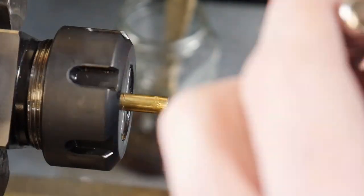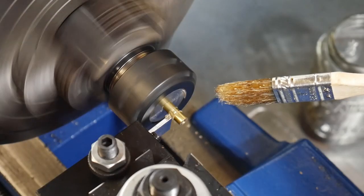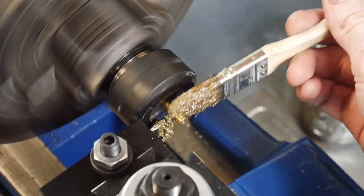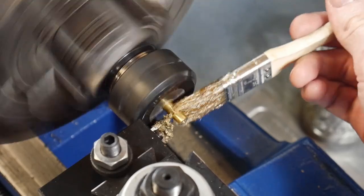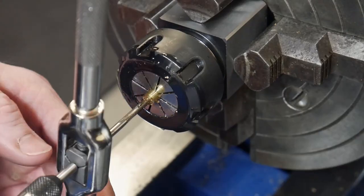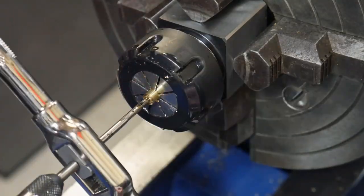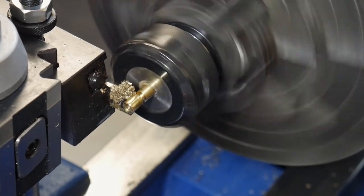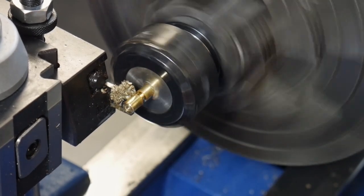Once we have about a quarter inch or a little over a quarter inch tapped, I use the cutoff tool to cut off one nut at a time. We'll get one nut cut off, finish threading the other nut, and then cut it off as well. That's how you make nuts for your Loveless fasteners on the lathe. The best thing about making your own Loveless fastener nuts is that you can make them out of whatever material you want — like copper, Micarta, or other exotic materials.